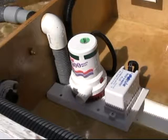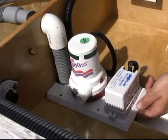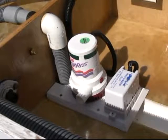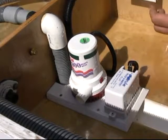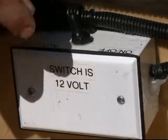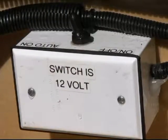You plug your hose into this, you have your unit on automatic. I have a water sensor up underneath the engine room bilge that will turn on this unit and vacuum out the water. One benefit is that because I'm vacuuming the water, I can get all of the water out. This is the remote on/off switch — 12 volt — that runs my pump assembly and my vacuum motor.